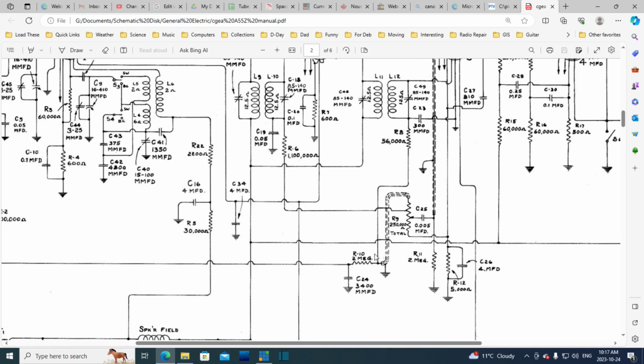So now we're going to follow the DC. Now, from here, there's really no current flow in this direction. There's nothing for the current to flow to. It's all open wires or a capacitor like this. So if we picture there's 20 volts here, there would be 20 volts here. There's no current to drop voltage across this large resistor.